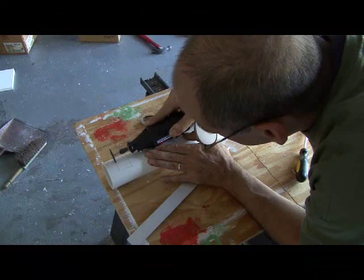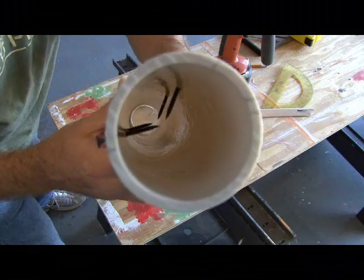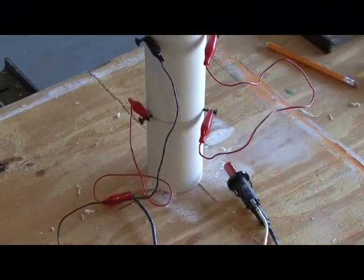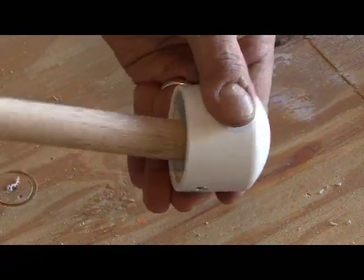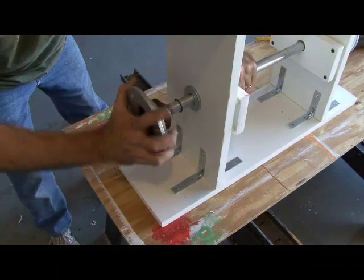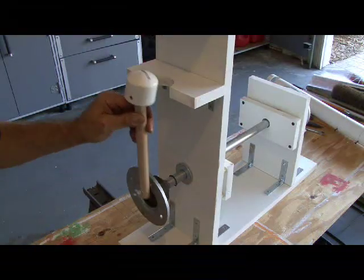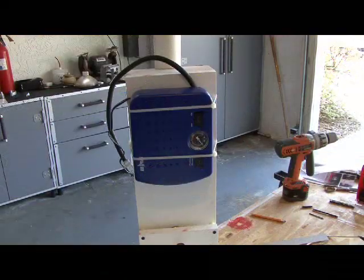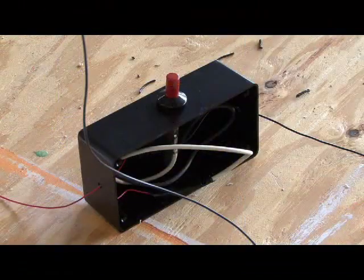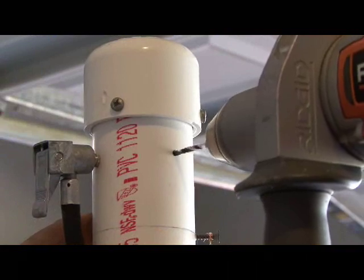We've built our crank bearing assemblies and our crank saddles and put everything together. Now it's time to build the crankshaft and our cylinder and the rest of the components. I cut an exhaust port in the cylinder with my Dremel and drilled holes for our spark plugs, which are drywall screws. Our power source is a grill igniter wired to the spark plugs and it does shoot a good spark across the plugs. A wood dowel, two-inch PVC cap and tension pin make up our piston and connecting rod. Pipe flanges are mounted to our galvanized pipe with adapters in the front and back, and the connecting rod is attached to the front flange. Our air source is a 12-volt compressor and it gets mounted to the back of the front support. I installed the igniter and wiring in a hobby box to keep it and my hands safe, and drilled two holes for our air and fuel.